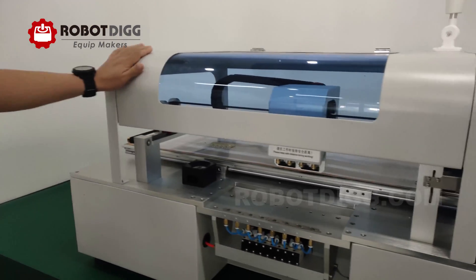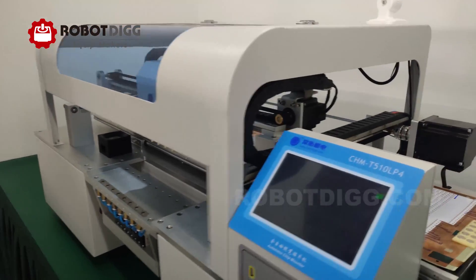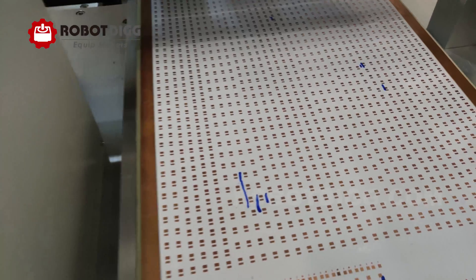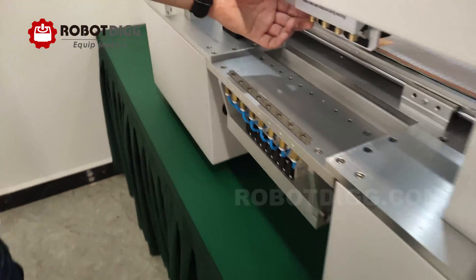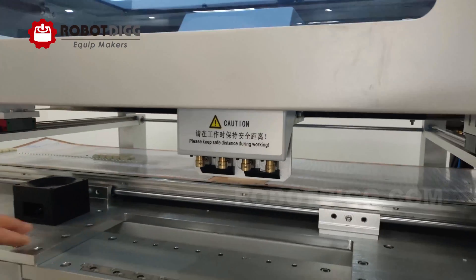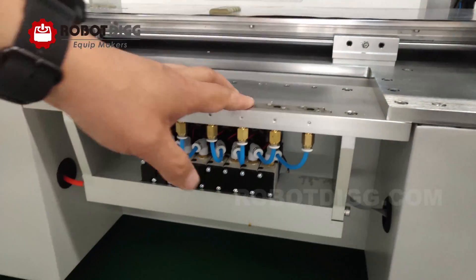And here you can find a specially designed LED pick-and-place machine. The part number is CHMT510LP4, which has four pick-and-place heads and can load 10 feeders.